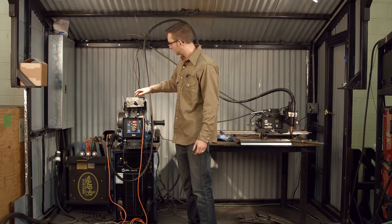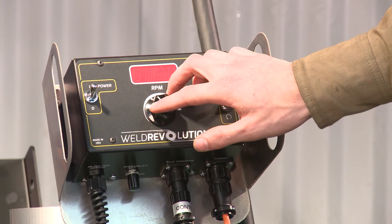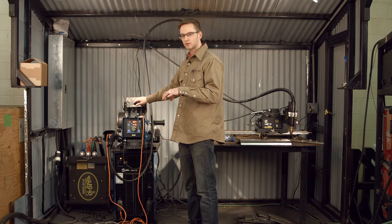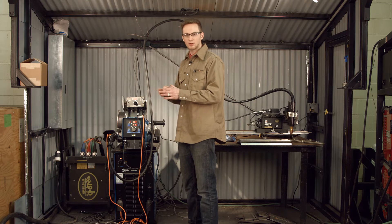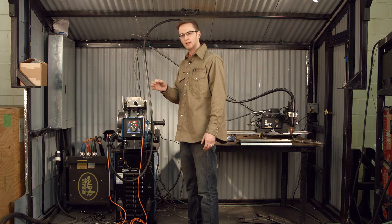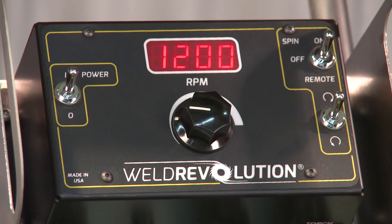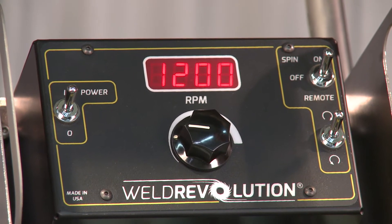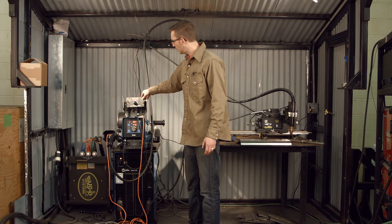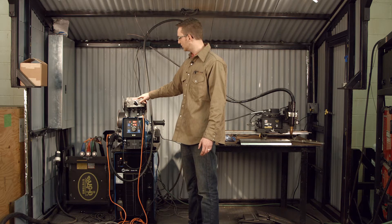This is just the power on and off. The other very important function is the dial that sets the RPM of the spin. The RPM at a set function and at a set diameter — which we'll talk about on the torch in just a second — gives you a small variation in your width. For this joint with a 3/8" gap, we're setting it at 1,200 RPM. Once it's set and you turn it on, it'll give you feedback to exactly what the torch is set at.